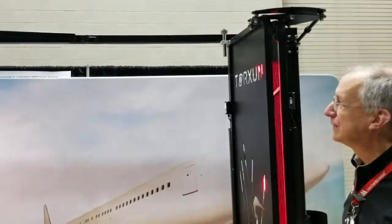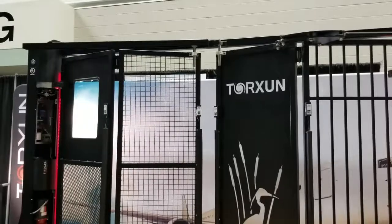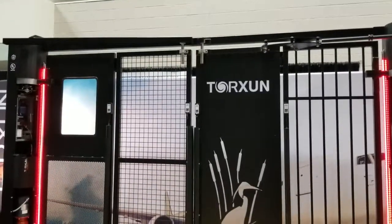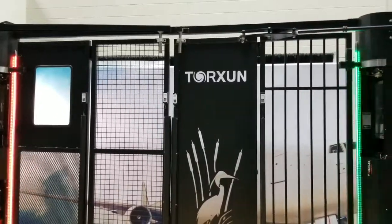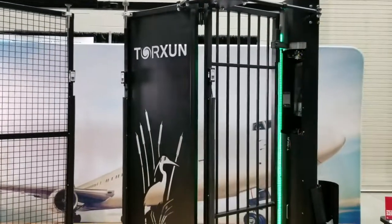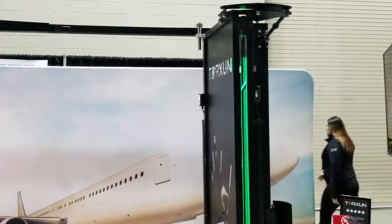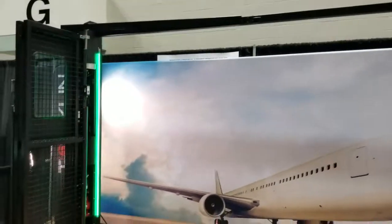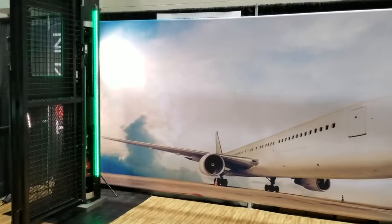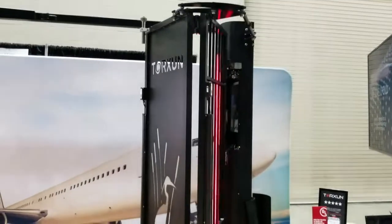You can see it here behind me — nice and quiet. The lights on either side are red when the gate is in movement and turn green when it opens up, which is a nice safety feature and gives it a little extra pizazz. This system can handle up to 24 feet of gate between the two towers — 12 feet operated by each tower — and very heavy gates are no problem. Any type of design — glass, metal, solid panels — is handled equally well.